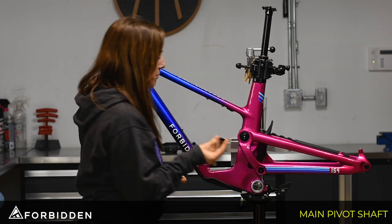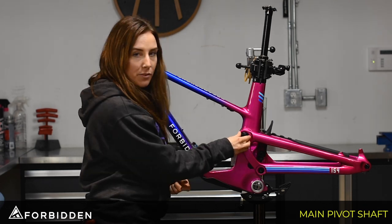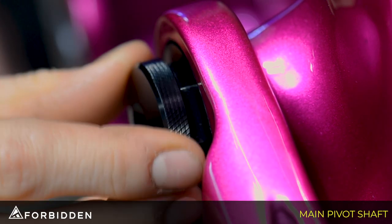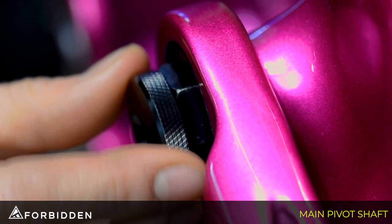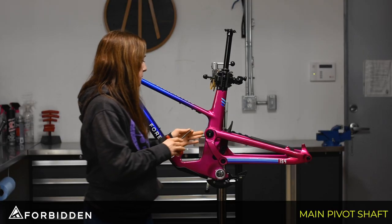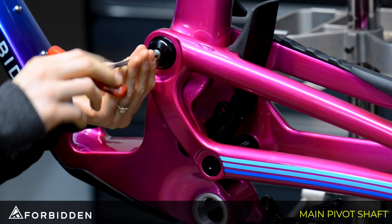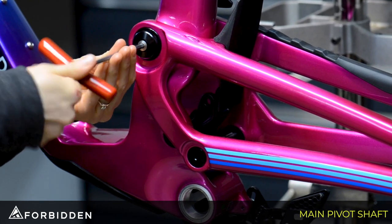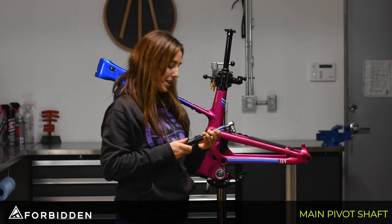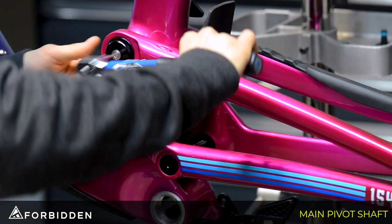With these features, you may notice that when you go to put the cover back on it doesn't quite fit right — all you have to do is turn it around until you get the right combination of fit and it just pops on. Once the cover is on, grab the screw and your 5mm, put that in, and using the torque wrench set to 8 newton meters, give it the final tighten.